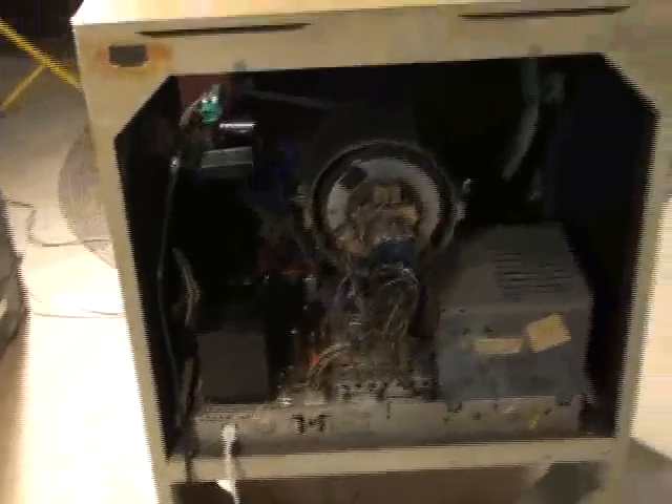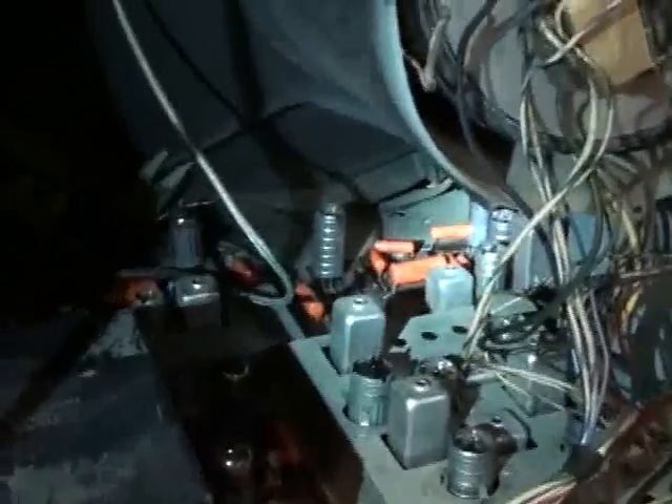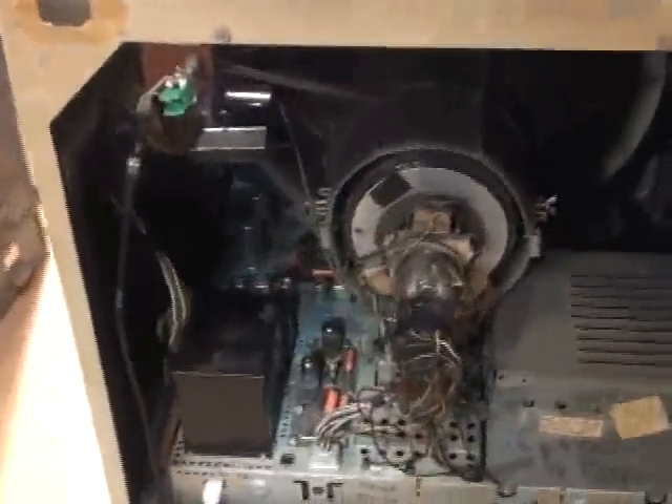I got the back off the TV so you can see the inside. There's the back cover. The TV is still in pretty good shape for its age. You can see all of the Sprague orange drops — mostly orange drops. Some of the different odd values Sprague doesn't make, so I had to use foreign-made caps, but fortunately there are just a few of those. The entire TV took about 49 individual capacitors, not including the electrolytics. The electrolytics had really good ESR on all of them but one — I changed that one cap out and left the others.